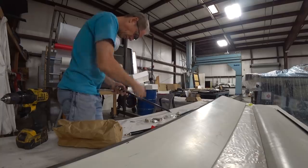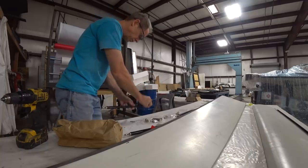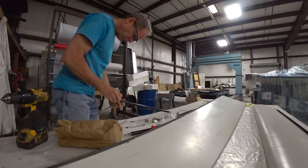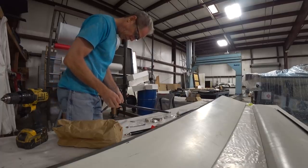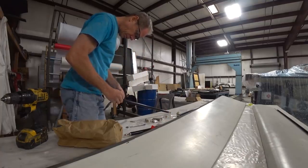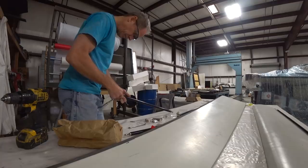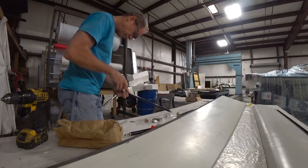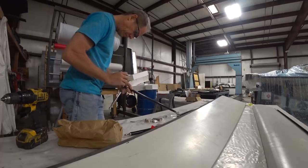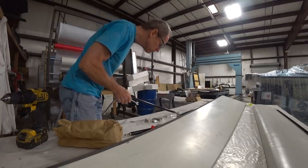After sanding all morning I spent the afternoon doing more work on the hardware — putting the bolts through those aileron rods, since I'd ordered them from Spruce and they arrived in the morning. Those are just AN3s, and they'll keep the rod ends locked into place on the tubes. The main aileron rods are now done. I still have to do the shorter ones that actuate the ailerons themselves, probably later in the week — getting close to having all the wing hardware done.